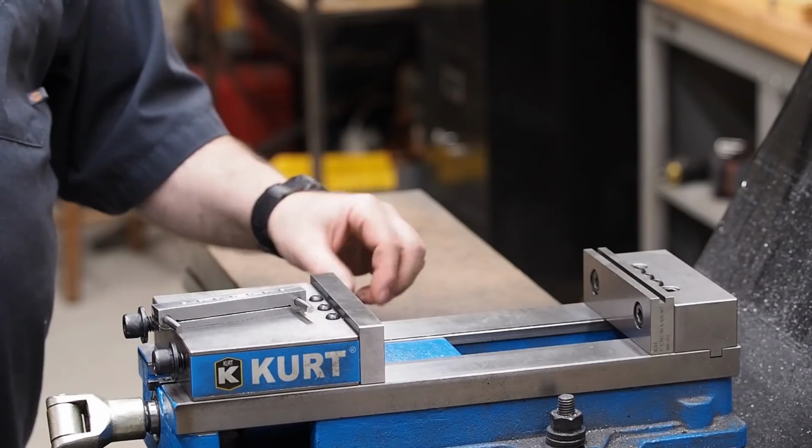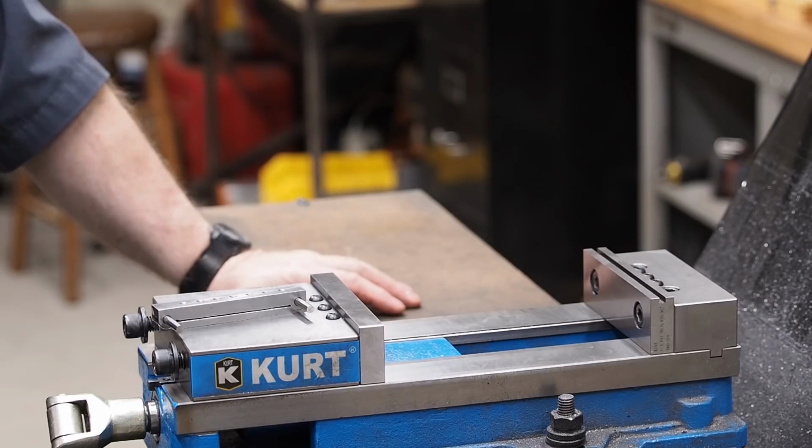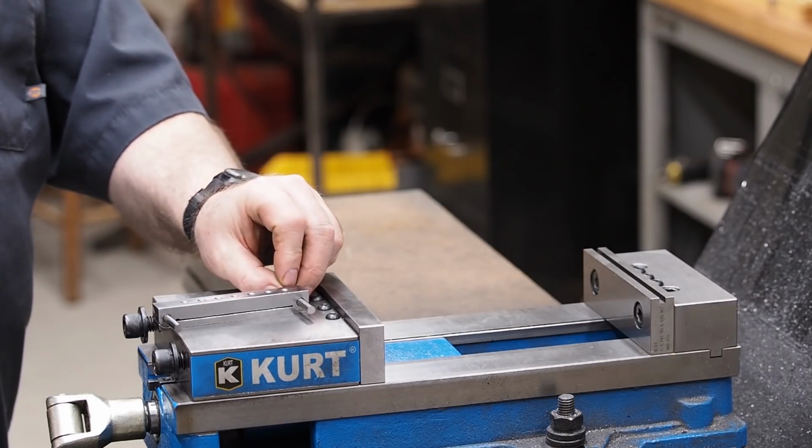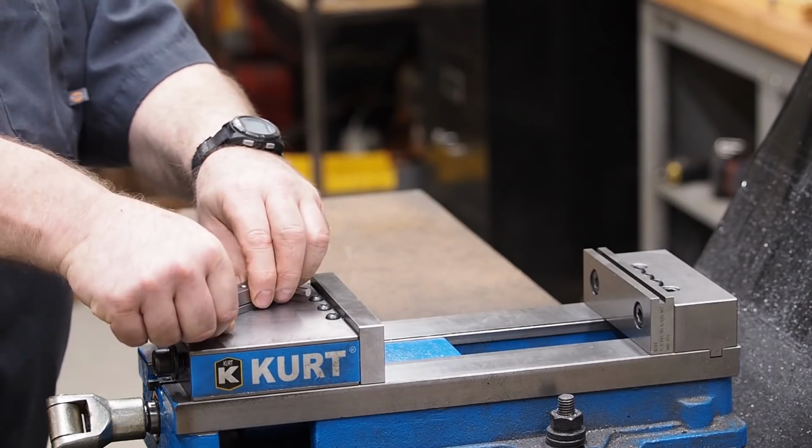So anyway, there's a lot of debate. A lot of people use a whole lot of different substances to harden, and the idea is to bring the temperature down quickly. If you use water, that's not a good idea because that's going to bring it down too quickly. They'll use a brine solution where you get the salt and water or a certain mixture, and then that will work too with different results. But we're just going to use canola oil. We're going to heat this up and then we're going to quench it.